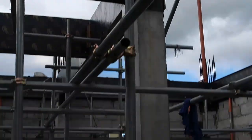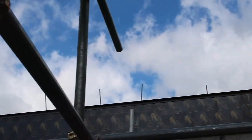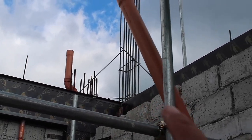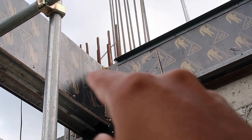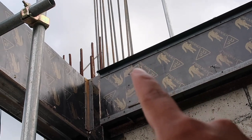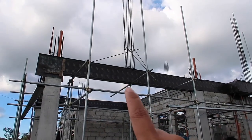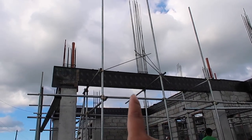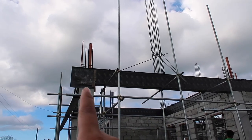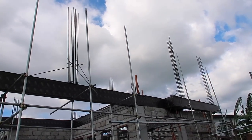Just an update — this is the middle column of our house. They already set up a column with a few stirrups, and that corner is the second, and we have the third column. If you notice, there is a rebar sticking out — that's from this column from the first floor — and they have to suspend that and create a new one where the overhang is. They haven't put any stirrups yet on this one. This is the end of our bedroom, so half of this garage will be our balcony, and that is the partition between the balcony and the master. We have four columns standing already.